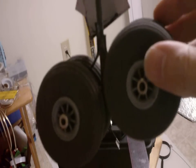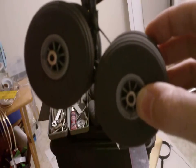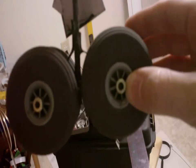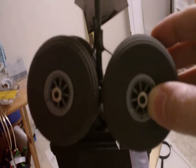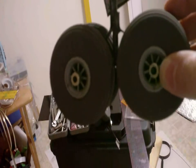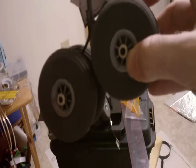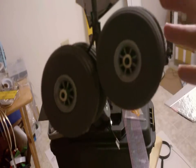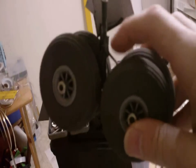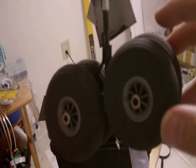On some landing gear, like the 747, it goes like that, so you would have to adjust it accordingly. On planes like the 757 and the 707, it is perfectly even, perfectly straight across. The L-1011 is also perfectly straight across. But some airliners, like the TU-154 (the Tupolev 154) and the 767, it is cocked forward like that. So that is the key — a piece of elastic right there. You can use a spring or other materials.